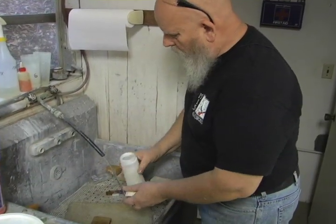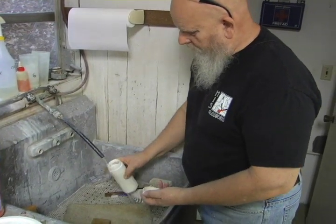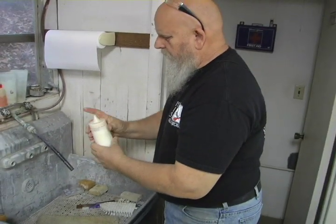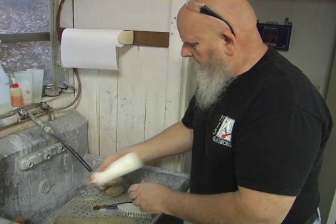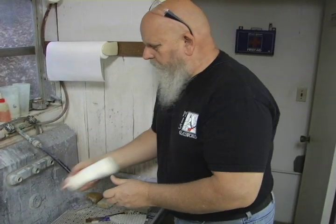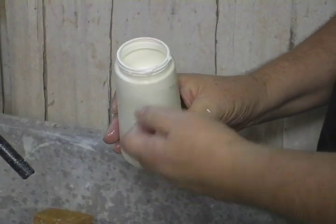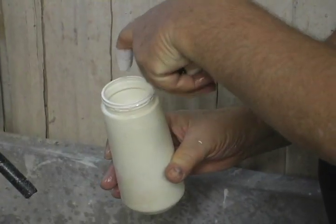Now a little bit of warm water — it doesn't have to be real hot, warm is better. I'll top it off the rest of the way with water. Make sure it's not going to leak; finger on the end, that really helps. Shake it up to form a slurry. You end up with a basic, very loose slurry of cerium oxide that covers.